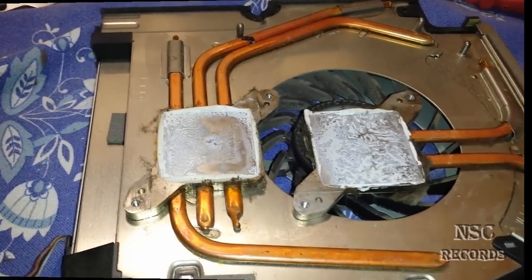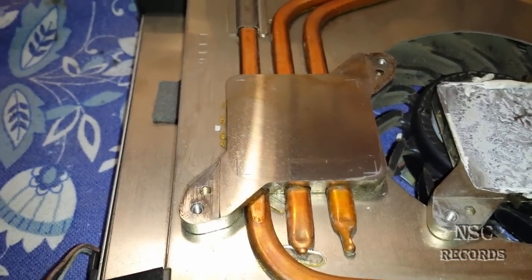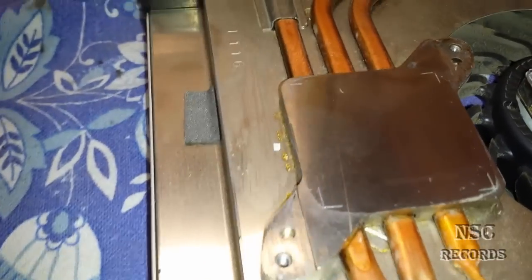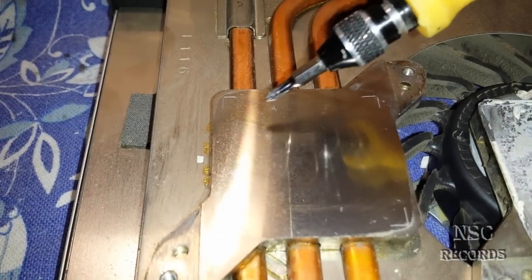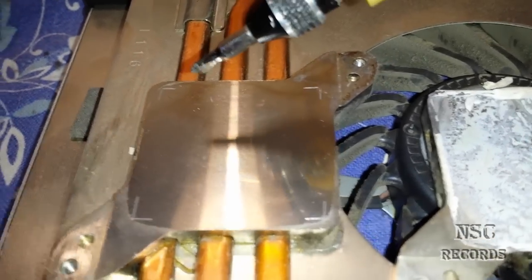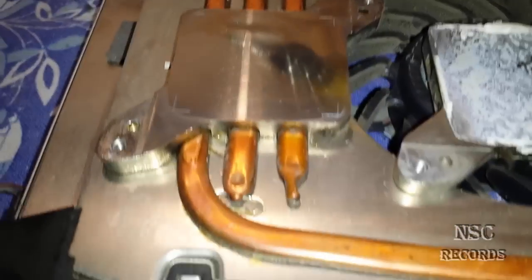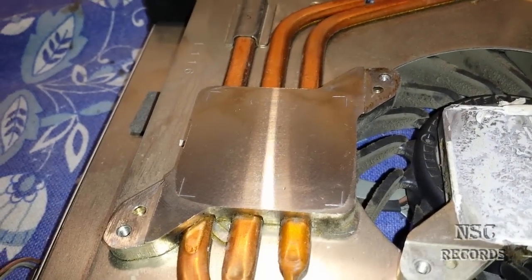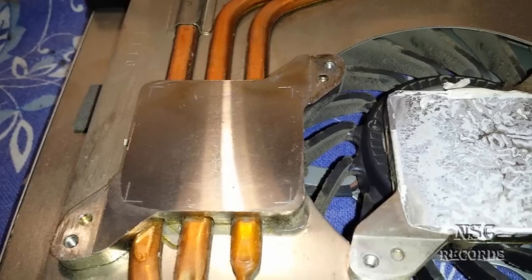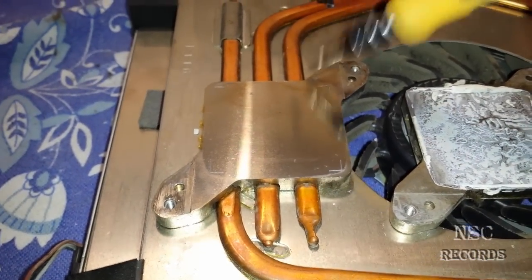I have now just cleaned the part where the CPU is sitting. You can also see there are other colors on the metal of the cooler itself — you can really see the CPU is running damn hot. The most problems come from the CPU side, and when the CPU is running cooler, the RSX will be the next concern.